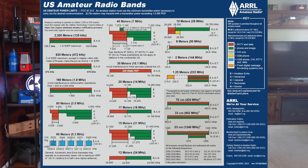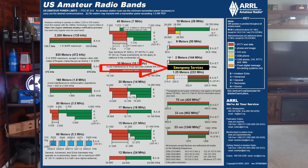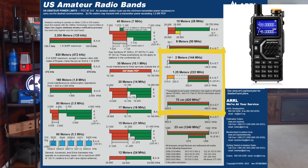Here's a quick explanation and demo using a radio frequency chart. On the 70 centimeter portion, that's your UHF ham band with lots of repeaters. Up on the 2 meter band, there are also a lot of ham radio repeaters. In between the 2 meter and 1.25 meter, that's where your GMRS channels are. Somewhere in between, there are emergency services and government frequencies you can listen to if they're not encrypted and are on an NFM or FM band. That's where your tri-band or dual-band ham radio listens.